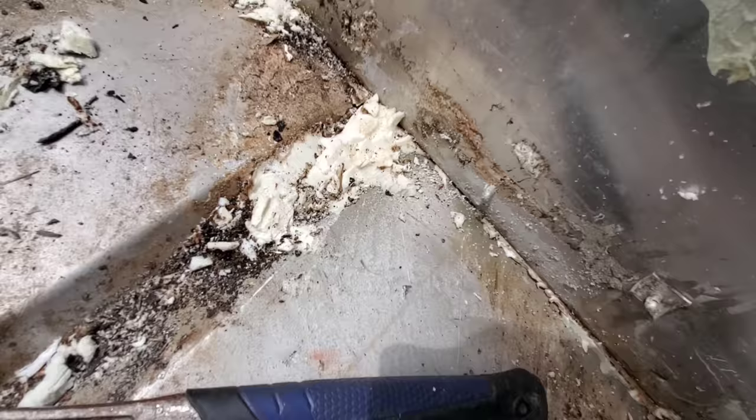Okay, got all my pieces cut and got everything in the boat test fitted. The rain's held off long enough for me to do this. And it looks really nice, guys. One thing I wanted to point out is that I leave a quarter of an inch reveal anywhere there's a joint for carpet laps. I'm running on this. We're just going to do very budget-friendly outdoor carpet from Home Depot. So I went ahead and factored that into my measurements when I cut everything out. But that gives you the overall design. You're just going to pull, lift, hatch. And that's all there is going to be to it.